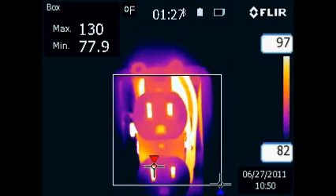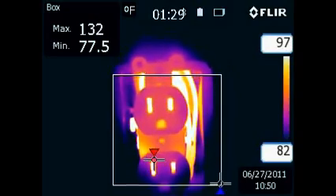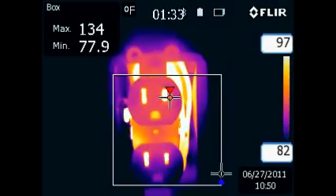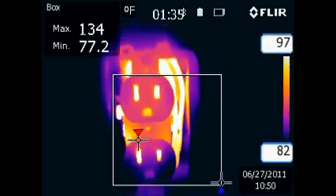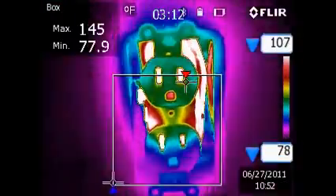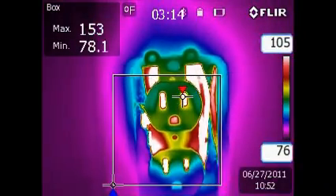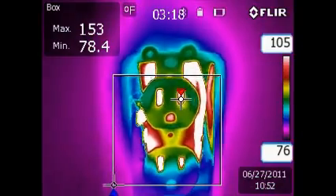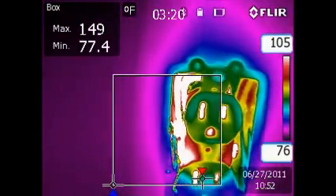But now it's time to vacuum your car. A standard vacuum pulls 12 amps, and the TV, the computer, and those few lamps are probably around 3 amps. Now we have 15 amps on this circuit, which according to section 210.21 of the National Electrical Code states 12 amps is the maximum allowable load on a 15 amp circuit — we have overloaded this circuit.